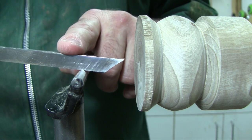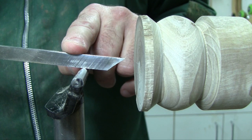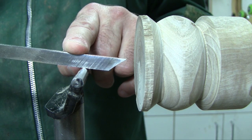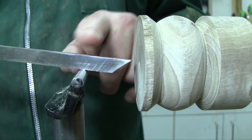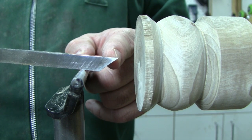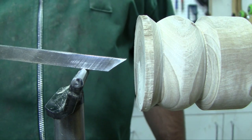The second function of the bevel is it affects the shape of the burr. A narrower bevel angle makes the burr come off the tip more, leaving a slightly cleaner surface, but the burr is more fragile and doesn't last as long. A wider bevel angle — around 70 degrees — makes the burr come up more. It doesn't leave as clean a surface, but it's much better for hollowing because the burr lasts longer. The difference is often negligible, but if you're having trouble getting a good finish with a 70-degree bevel, try something narrower.